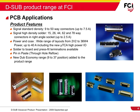For PCB applications, FCI offers standard density from 9 to 50-way connectors with stamped and formed contacts that provide current carrying capacity up to 7.5 amps. For further space savings on the printed circuit board, FCI offers high-density right-angle receptacle connectors in 15, 26, 44, 62, and 78-way configurations capable of carrying 2.5 amps.